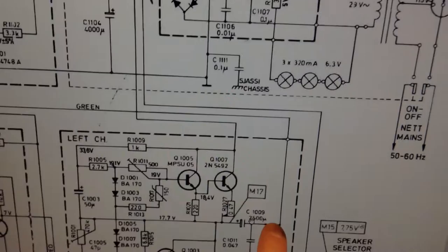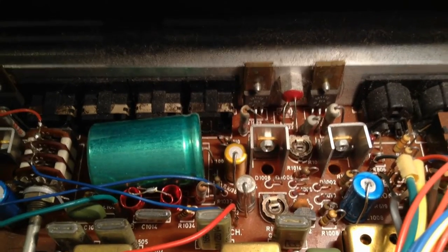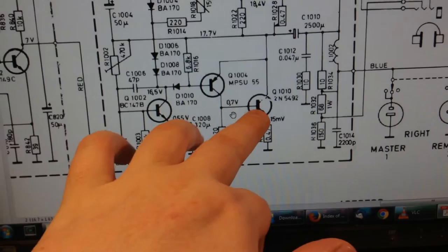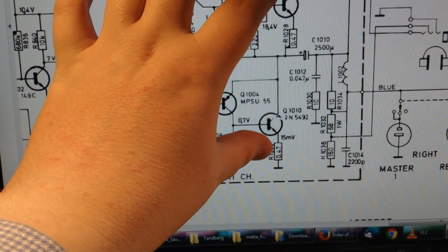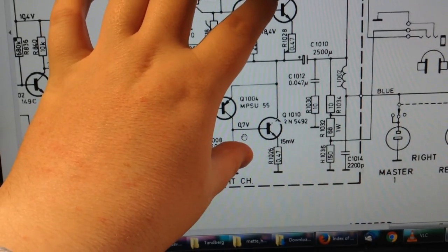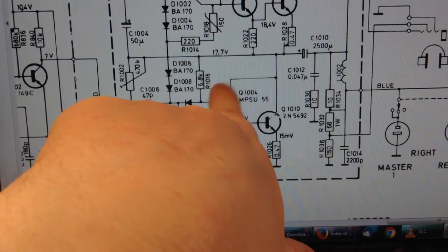This is the power going to the power transistors — there you see them, they are 2N5496. The other transistors with heat sinks are all dual transistors, and I think maybe they're providing power for biasing. You have to bias transistors like this to make them fast and smooth the transition from pull-up to pull-down. They have to be ready whenever needed. Switching transistors on and off makes them slow and causes distortion, so you keep them on all the time.